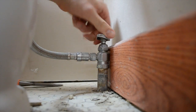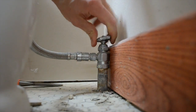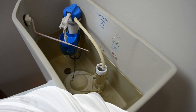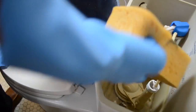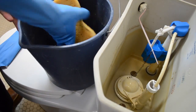The first step is to just turn off the water valve. As you can see in the image here, this toilet has a water valve included. Next, flush your toilet so you can remove all the water from it, and then once you do that get a bucket and a large sponge and you can sponge out the remaining water from the top of the toilet.